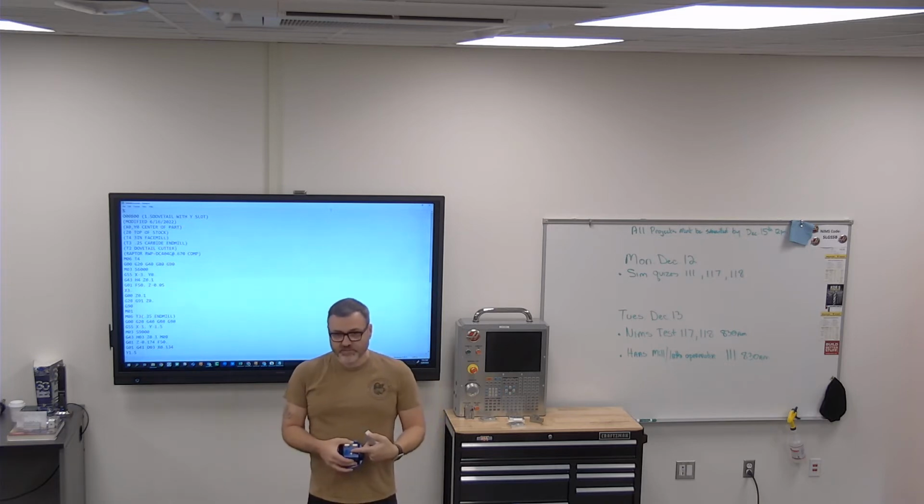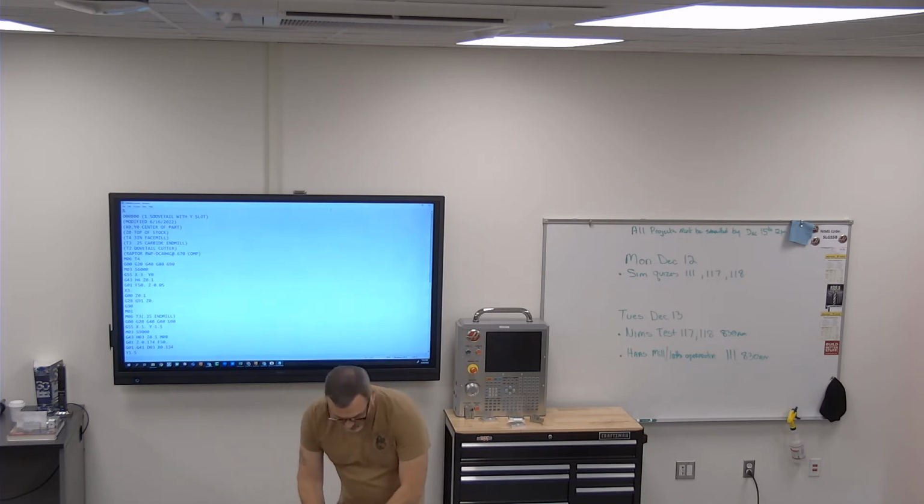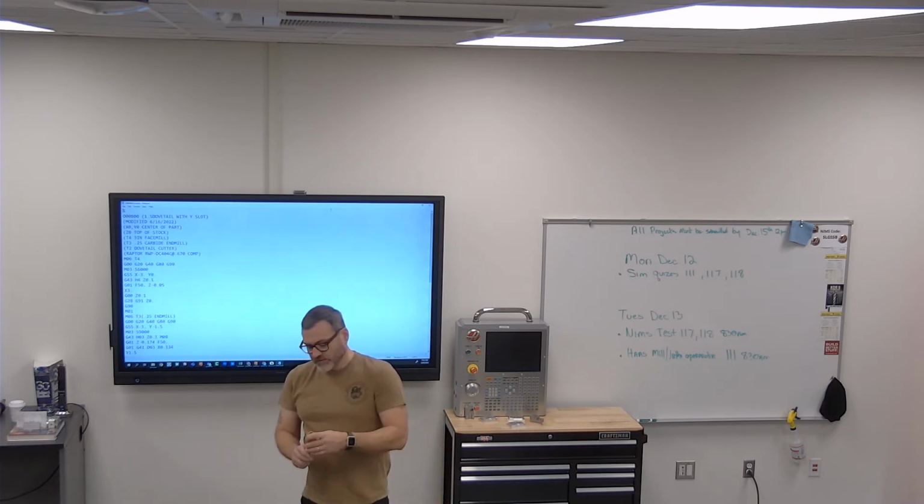This happens to have this pin in it, and that's why it just locates Y or X. So you've got this locating Y, you've got this locating X. That means no matter how many times I try to put this part in wrong, it really only goes in one way. You could really try to do it wrong, but you're going to have to work to do it wrong.